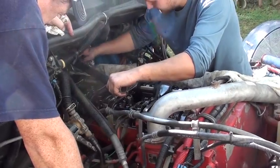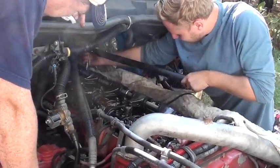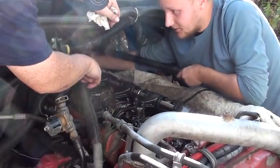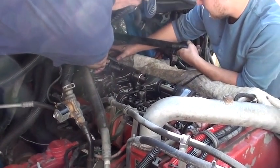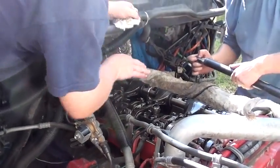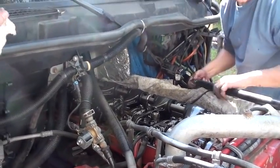Sometimes you need the leverage if you have a really short wrench. What I like to do is leave two in the middle — the one on either side of number five in this case — and take all the others up first. Because you have a lot of spring force in there, and then you take the other two up last so that the spring force is relieved, with just the last two.